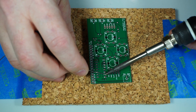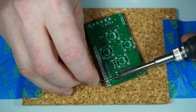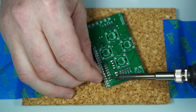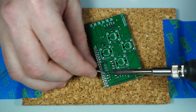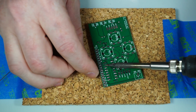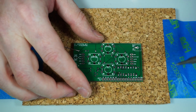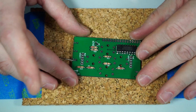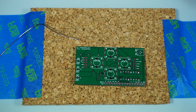So yeah, we're using this shift register to turn the SPI bus plus 2 extra pins into 6 outputs. It saves a lot of I/O pins on the Arduino, or the ATmega, I guess it is. And it also gives us a couple extra pins with which we use these LCDs, or LEDs. All right, what's next?